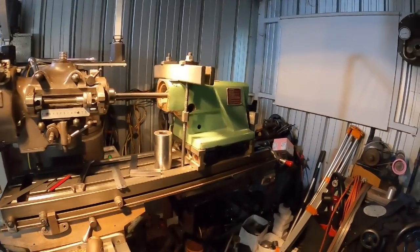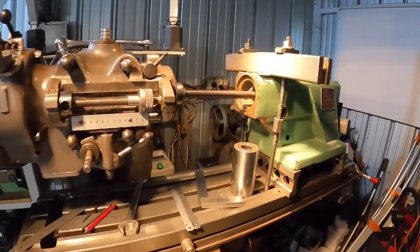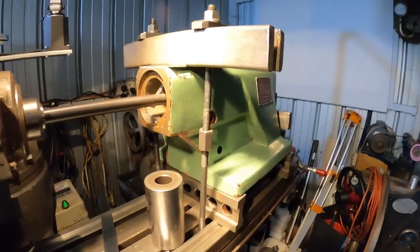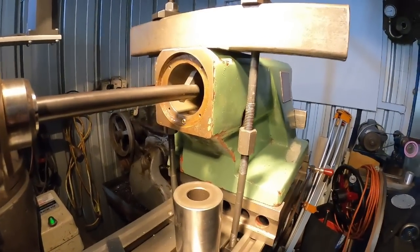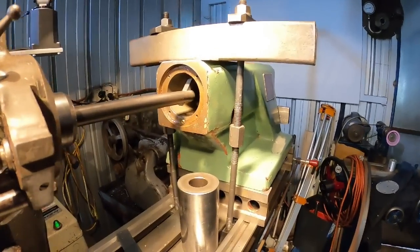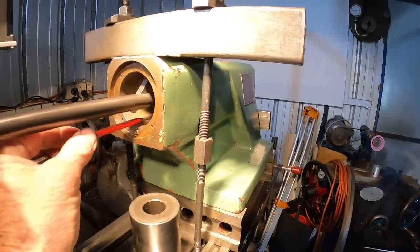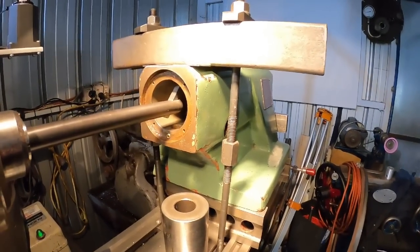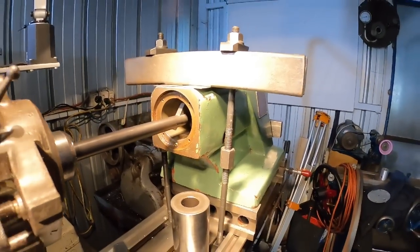So we have our tailstock back set up in the bridge port, and we have a boring bar set up. Now this boring bar we're going to do some slotting, as we're going to put a blind slot. That's a slot that doesn't have open ends in the 12 o'clock position for the tailstock quill. Now that should alleviate the rust issues that were getting created at the 6 o'clock position, so it should allow oil to levitate around the quill where it had no way of doing that before.